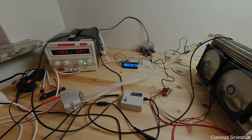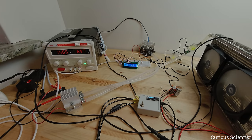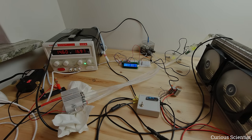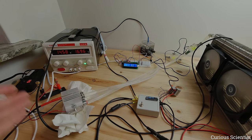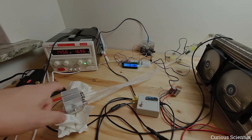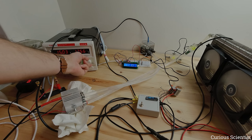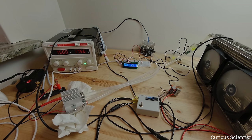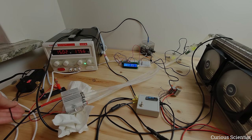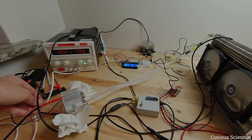There are a lot of wires here which will collect moisture, so I put a paper underneath. If I touch the cold side it's crazy cold — it's actually already minus 7 degrees Celsius — and it's exposed to the environment, so it's vulnerable to moisture. I can already see ice collecting on the surface. I'll increase the current a little more to maximize the use of this unit. These cables are running hot — I can still hold my finger on them indefinitely, but they are definitely hot.